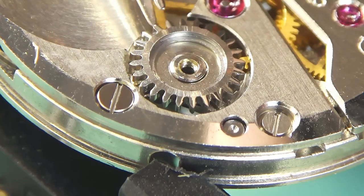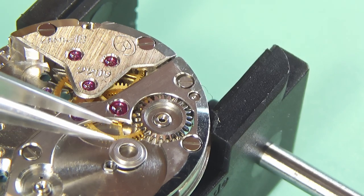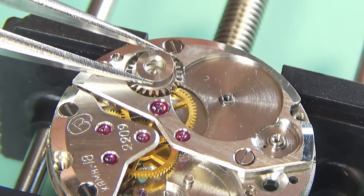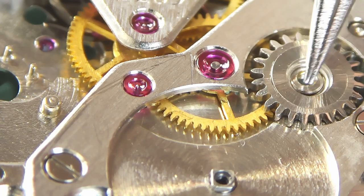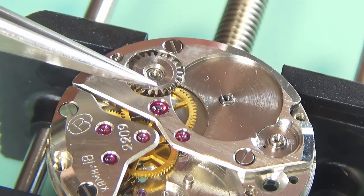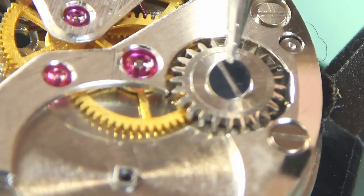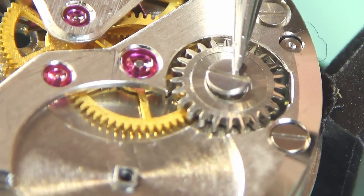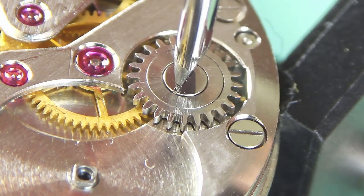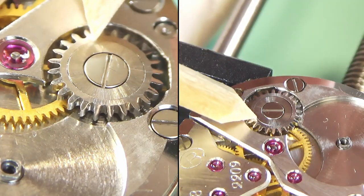So the crown wheel going back together, the three parts that make it up there. And this is a fairly standard crown wheel. I've seen this on quite a few designs. Nothing to see here. Just really the train of wheels that's a little unusual on this one. And that second pinion and the free floating minute wheel. Kind of not seen that before. A design that leaves no center wheel, so you can get a larger balance in, as I believe I mentioned.